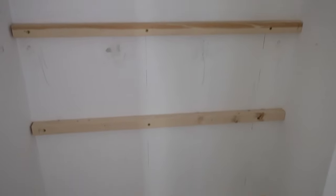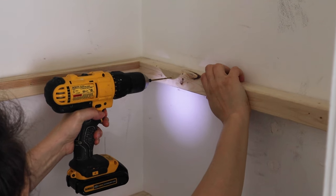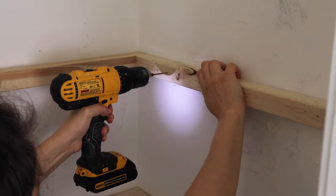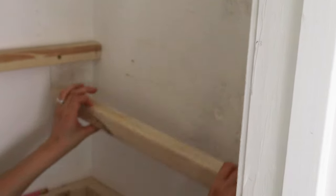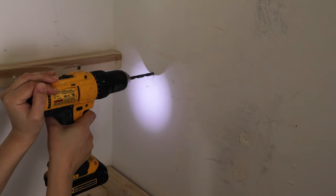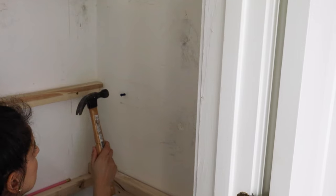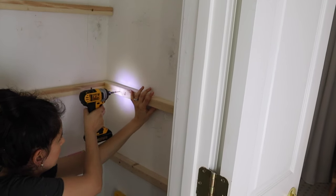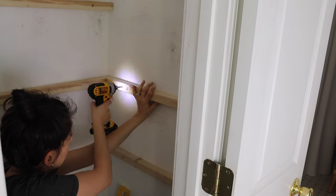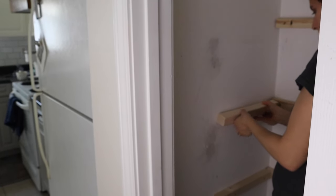After the back supports are installed, attach the right and left wall supports. Unfortunately we didn't cross any wall studs on our left wall and one spot on our right wall, so we had to use wall anchors. To do this, we nailed the 2x2 in place and pre-drilled a pilot hole through the 2x2 and wall. Then we carefully removed the 2x2 from the wall, drilled the hole for the anchor, and tapped the anchor in place with a hammer. Next we put the 2x2 back on the wall by lining up the nails with the nail holes and installing the screw through the pre-drilled pilot hole. This method allowed us to make sure our holes were all perfectly lined up. Make sure these 2x2 supports are all very secured to the wall.